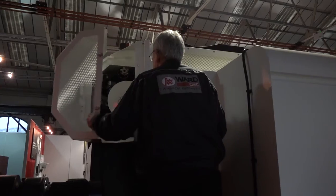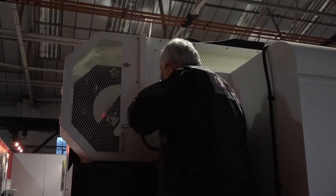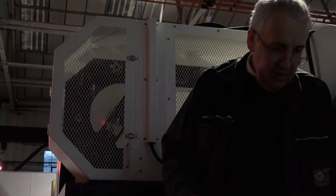So the machine can be in action or in operation while you're at the back putting tools in? Yes. And what tools? Is it BT40 or BT50? They're BT50. You can have DIN50 or BBT50, and our standard now is BBT50.